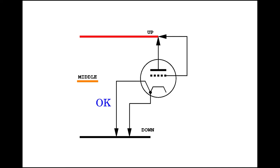The corresponding levers should be moved in parallel, but such an action is not always easy to make, and the possibility to provoke a short circuit is very high. Therefore, during a test, it is advisable to avoid moving levers that are related to internally bound pins.